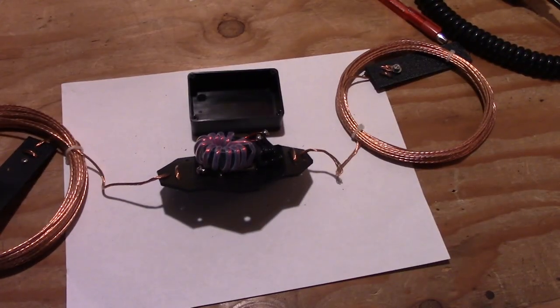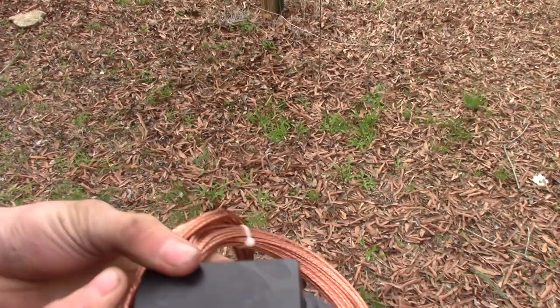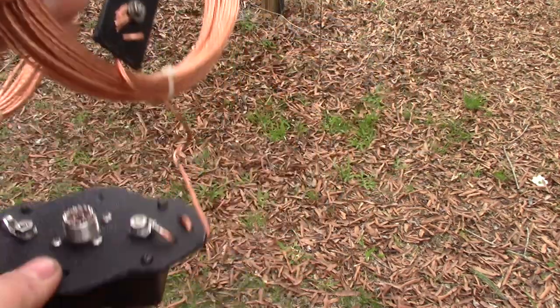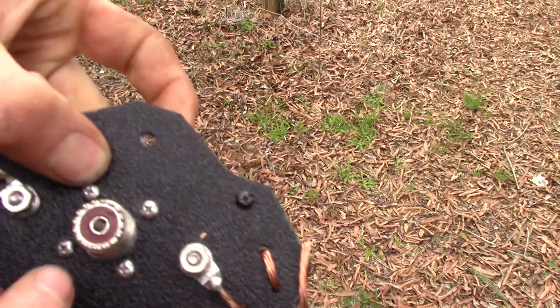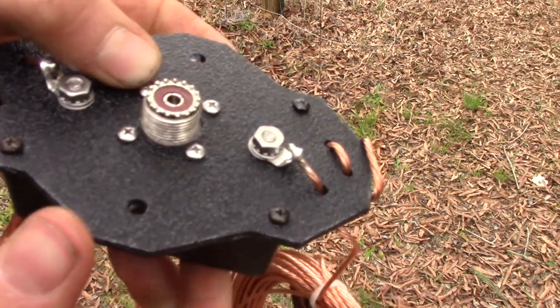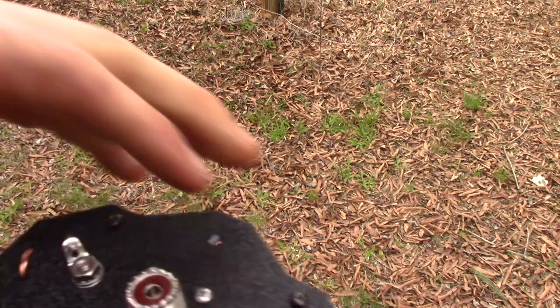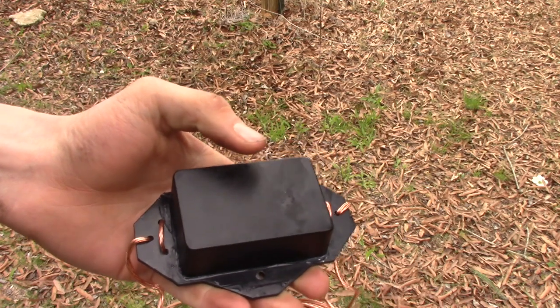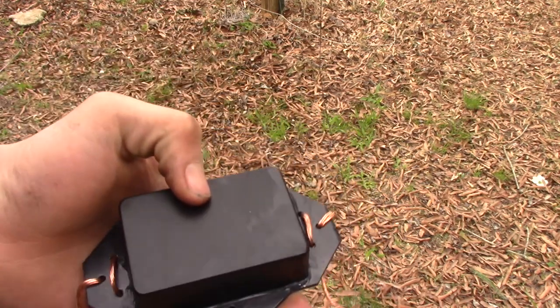So time for step three. I opened this up and got silicone around the entire outside and also inside of the SO-239. You can't really see it, which is a good thing, and got it all crammed in there. So once this dries it'll be waterproof. We're not looking at any rain too soon, so I should be safe to put this up, although it is overcast.